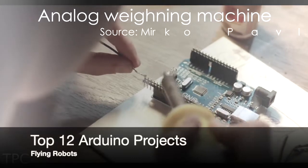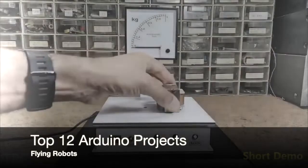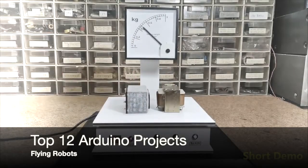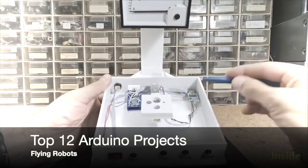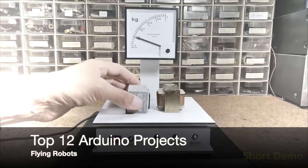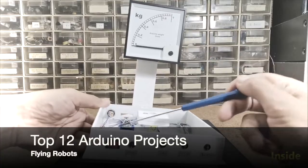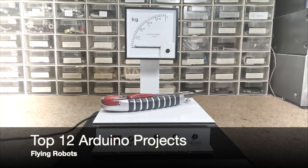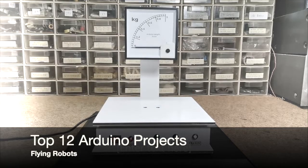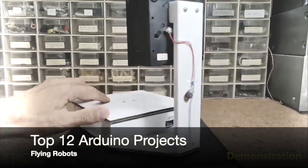Number 2. Sometimes you need to measure the weight of lighter objects precisely — for that, digital weighing scales are available. But what's better than an analog weighing scale for old schoolers like us? It uses a load cell, which is a transducer that creates an electrical signal whose magnitude is directly proportional to the force being measured. This result is displayed on the galvanometer. Before using the scale, it requires calibration — for that, 3 LEDs are provided on the setup. Once completed, this scale can precisely measure weight up to 1 kg. If there is a deviation from the marked scale, calibration can be performed with the help of a trimmer potentiometer.